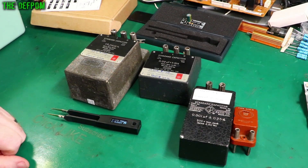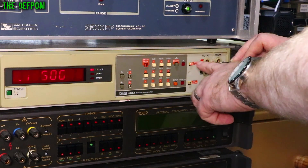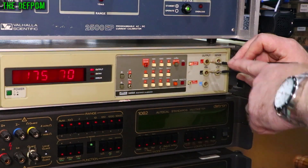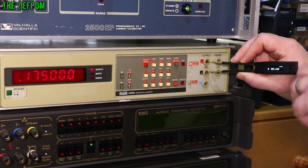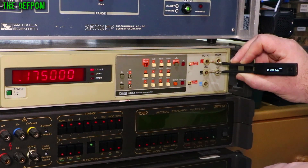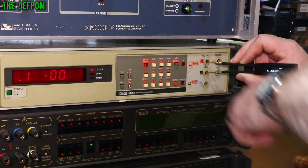Let's chuck up my resistance calibrator and do some testing. I've got it on a short, on two-wire mode, so it should be allowing for a factory offset using a single terminal. I can just get in here, though I might have to wiggle it around a bit to keep it constant. I've got 135 milliohms as the default for two-wire.